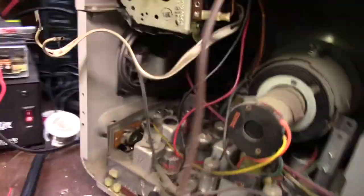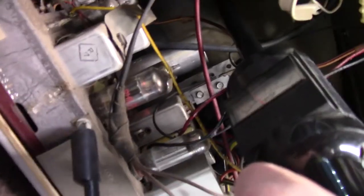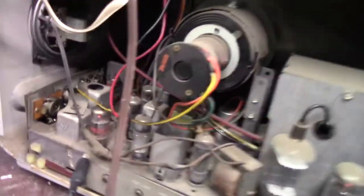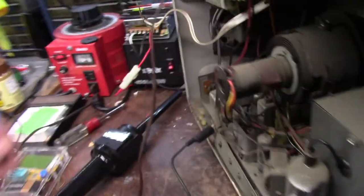That's very promising. I wonder what popped — maybe high voltage shorting to some spider webs. Let's get in here and — oh yeah — 12,000 volts. That's spot on! Great. There's some stuff that's shorting in here. I don't know what that's all about — could be dirt, high voltage arcing across some dirt. I don't want to run it too long because I don't want to destroy anything. This is a really nice TV with a really good CRT. Brightness — oh yeah, look at that. Excellent.